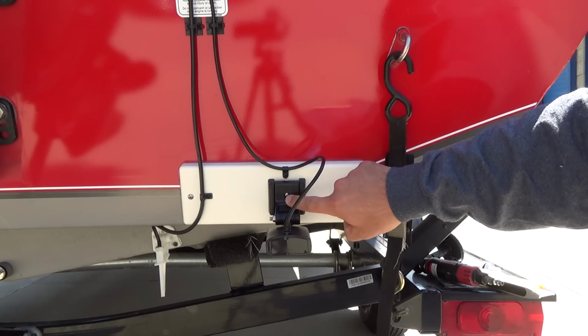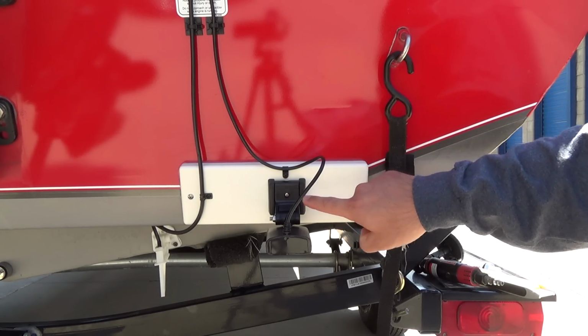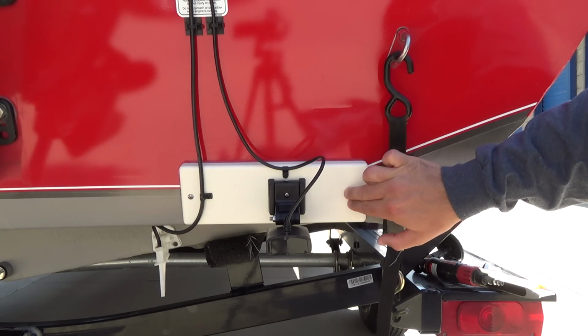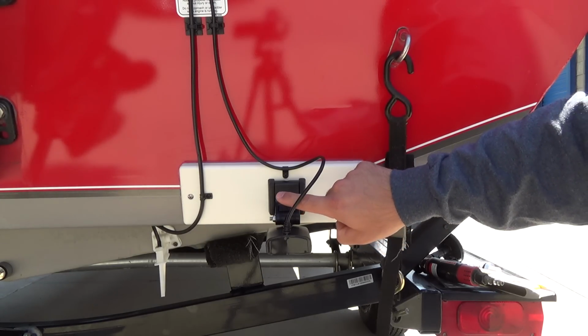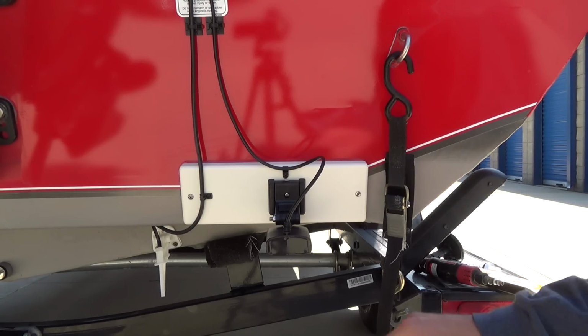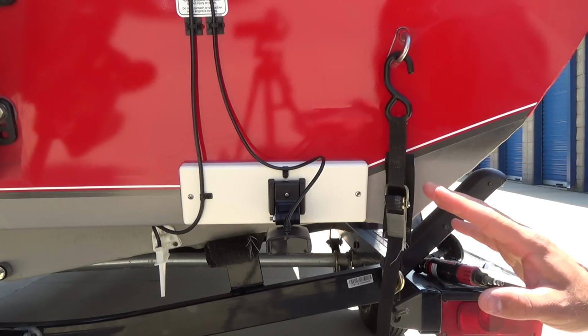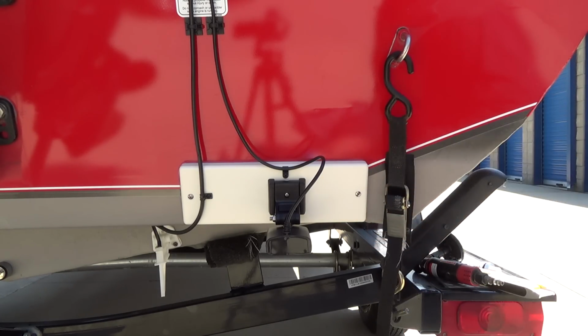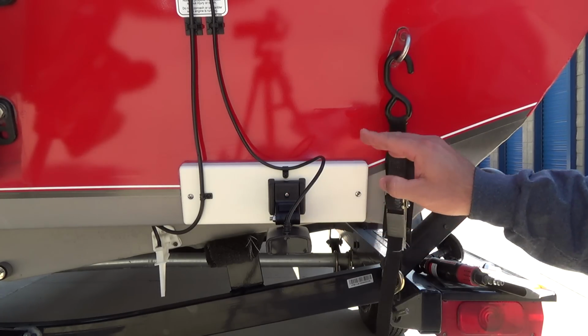The screws that come with your transducer, once you put them through the bracket, are no longer than the thickness of this material. So like I said, you mount the plate to the boat, then mount your transducers to the plate. Now if you want to add another transducer, or maybe you got one at the wrong height, and you have to re-drill, you only drill into the plate and not your boat. If you guys remember my 598 install video, I had an issue where my transducer was too low.